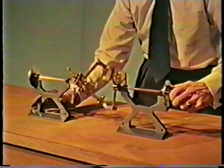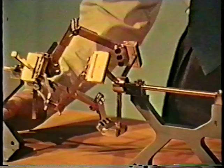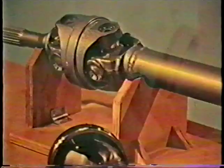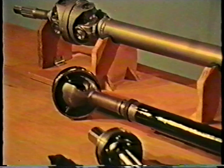But of course, to convert any one of these geometries into a realistic engineering design requires a detailed knowledge of the particular situation. There's no problem in any of the new couplings about balancing them, statically and dynamically, either perfectly or very nearly perfectly. Power couplings, particularly in automotive transmissions, seem to be quite well covered by existing rugged and compact shaft intersecting couplings that transmit uniform speed adequately precisely. But in precision engineering of one kind or other, there could be some applications for new couplings included in this wide range of newly revealed possibilities.